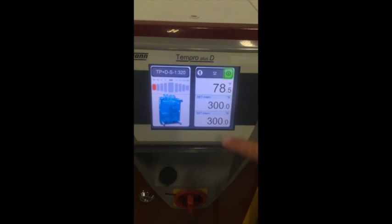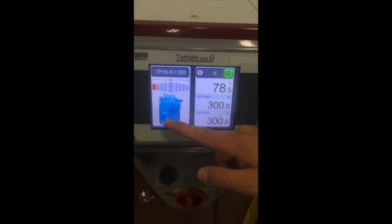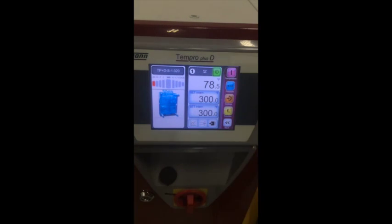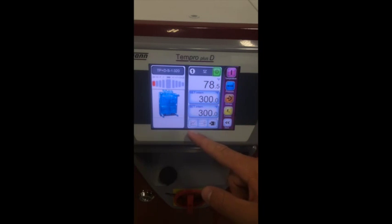You can also tell what state the device is in based on the color of the tool symbol. Gray shows that the circuit is switched off. Green shows that the circuit is switched on and that the actual temperature of the medium corresponds to the prescribed desired temperature. Blue shows that the circuit is on and that the actual temperature is lower than the prescribed desired temperature. Red shows that the circuit is on and that the actual temperature is warmer than the prescribed desired temperature. The top row shows the actual temperature of the circuit, while the two rows below display the selectable values to be defined as required. The last row includes the fast function selection buttons which allows for quick changes required for production methods.